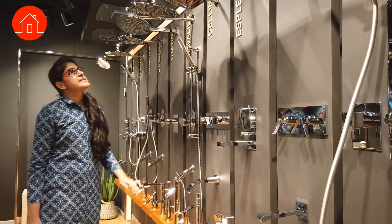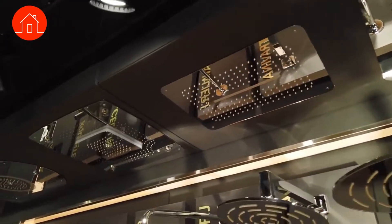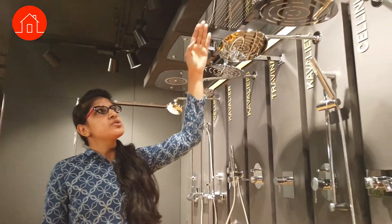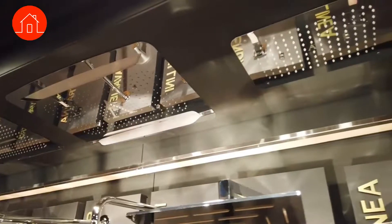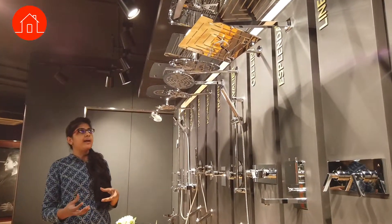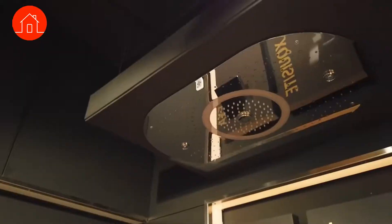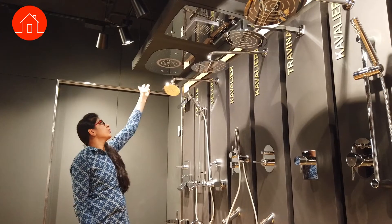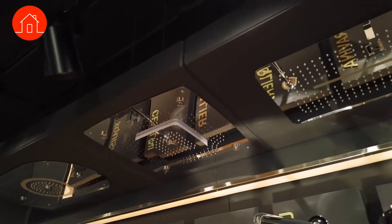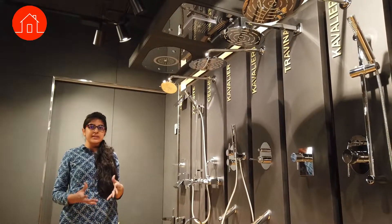Now I will tell you about the ceiling showers. You have to install the ceiling showers inside the false ceiling, from about 1 foot recessed. The ceiling showers here include a rain shower and mist function. The mist basically creates small water molecules, which will give you a soothing effect. You can operate the pressure and enjoy a relaxing shower experience.